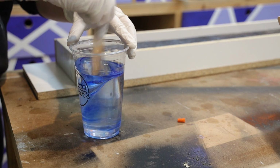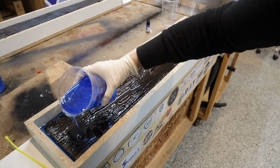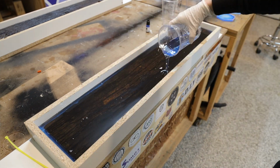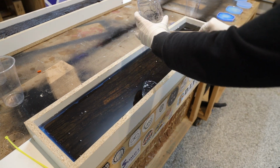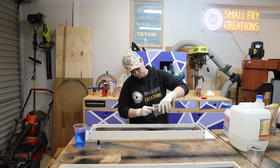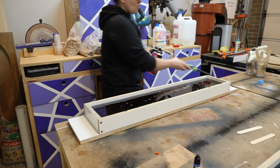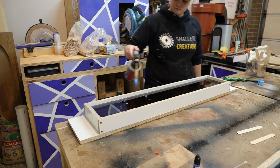This is where the real roller coaster began. I poured the resin so the timber was completely covered. My original plan was to have the timber covered in the resin. However, as you will see, this was not possible in the end. I had a ton of air bubbles coming up that just wouldn't go away. I used the heat gun and I sat with the resin for over an hour to try and get them to come out, but it just wasn't great. I think because the timber is so old, and let's face it, it's extremely rotten, there's so many air gaps that the resin couldn't fill in and the air just continually kept coming out.